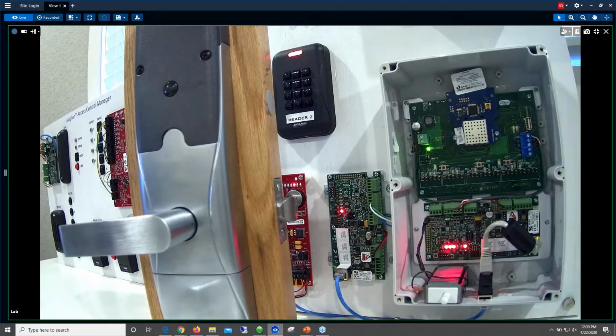We've still got to think in theory of reality here. If you're trying to get it within a certain range, you can basically shoot the signal over to the location. Keep in mind the PIM 400 uses 900 megahertz as well, which is not the same as the NDE. 900 megahertz has the ability to blast through objects a little bit better than 2.4 does. So typical interior walls and things like that, a lot of times you can extend your signal beyond what you might think you can. However, Rob is absolutely right. Using the test kit, using your local Allegion resources.